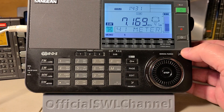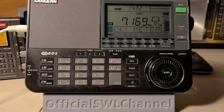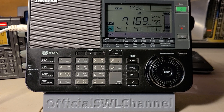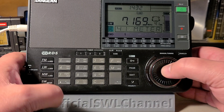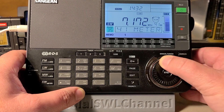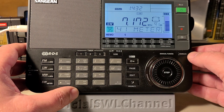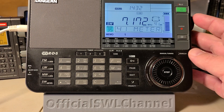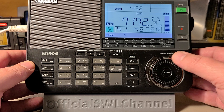If it's the default that you're using, you might be transmitting from about 300 to 2700. You might be able to widen that out a bit. Do you know what you have that set at? The low end is at 300 and the top is above 2400 — maybe right around 2400 or 2500. It all depends on what you're trying to accomplish — if you want a narrower sound or more fidelity. It doesn't have the same flexibility and filters, so you don't have the same adjacent signal rejection.